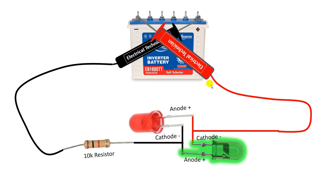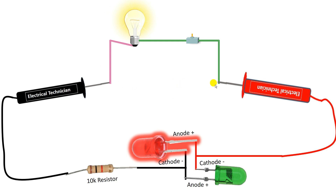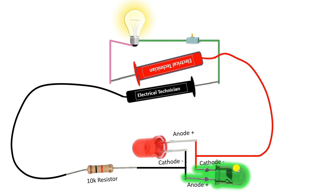If I interchange both probes, you can see the green LED is glowing and the red LED is not glowing. If the green LED glows, it means the probes are connected on opposite terminals — that is, the red probe is now at the negative terminal and the black probe is at the positive terminal. Now, to identify in a circuit which wire carries positive and which carries negative supply, simply connect the probes. I connected the red probe to one wire and black probe to the other — the red LED glows, meaning the red probe is on the positive wire. If I interchange them, the green LED glows, meaning the red probe is now on the negative wire.